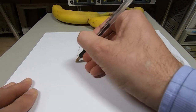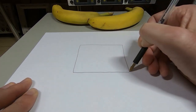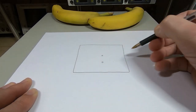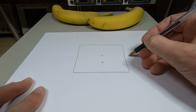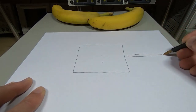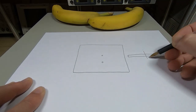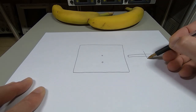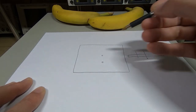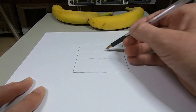So inside the chamber originally there were 2 sensors. One was located in the center and one was located forward of center. And looking side on, if we have the heaters at this height, then one sensor extended down about 20 millimeters below the level of the heaters, and the other one was just slightly higher. And the heaters are located like this.